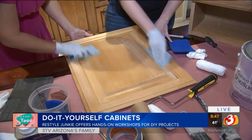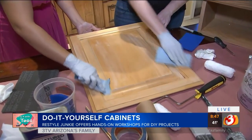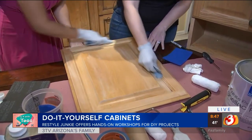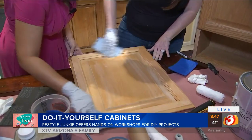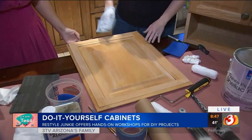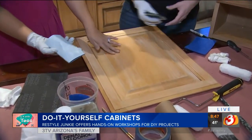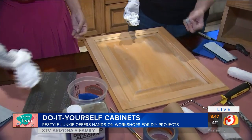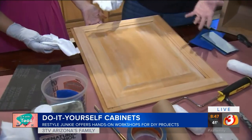We're going to get into the little grooves, especially where our hands may have been with lotions and whatnot, just to see if we missed anything, because it will show up white if we missed any dirt here. Okay. And then we'll know that we need to go back and clean it again. Okay. So you do your best to stay with the grain. You're going to do the front and the back. And you're going to notice a little bit of powder. That's kind of like the varnish top coat coming off. And that's what you want. You want little micro scratches in there. Nothing that's so visible to the eye, but under a microscope, it would be really visible.